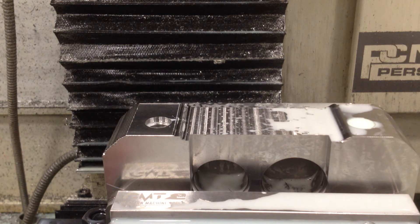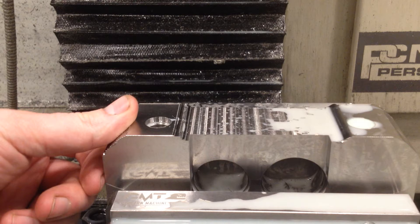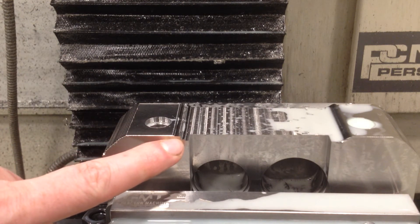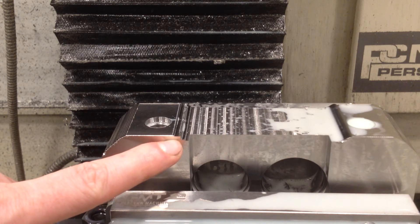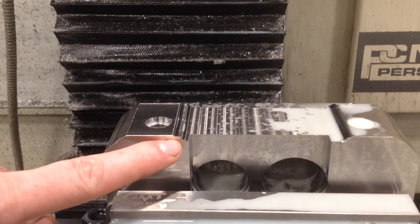So I adjusted the CAM on the roughing toolpath and I'm happy with this side — that should be fine for the ball mill to come back and clean up. However, there's still a whole lot more material there than I would like to see. Forgive me for not making videos actually showing the CAM part; I'm still learning Fusion so I'm not that comfortable making those videos. I'm going to go try to get rid of this and try that again before I run the ball mill.